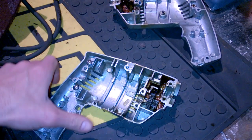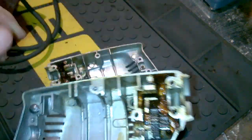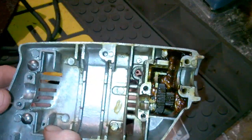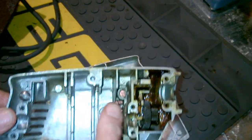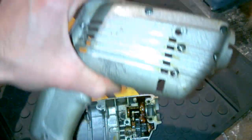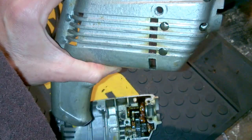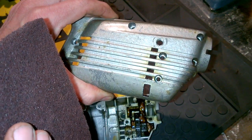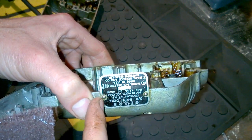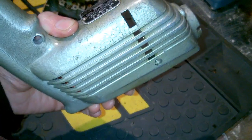I cleaned out the innards, scraped out some of the dirt and grime, got some degreaser on there, and pulled out the old grease from the gearing areas as best I could — we'll put fresh grease in those sections when the time comes. It didn't look terrible, but this had been used for woodworking — there was a decent amount of sawdust near the gills and fins. Next up, we're going to scuff it down with a red maroon pad, get it primed, then repaint just the outsides. We'll mask off the badge down there rather than drilling it out — easy enough to just mask it off.